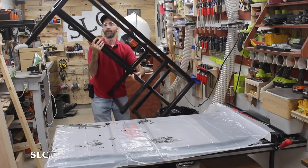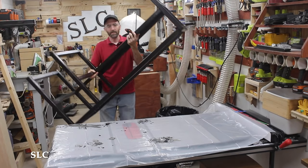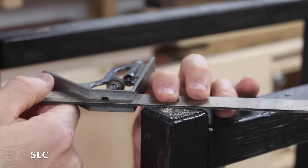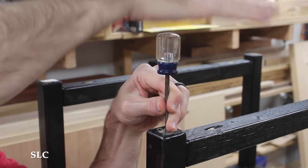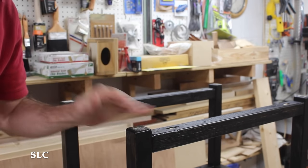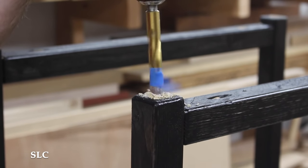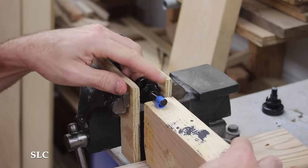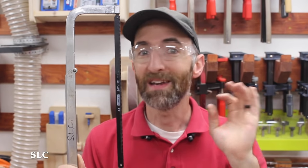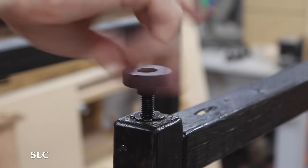After the polyurethane became dry to the touch, I flipped the frame over to install the levelers. This also gave me the chance to check the rigidity of the frame, which was very solid. To find the center of each leg, I used a square laying across each corner and made a mark with a pencil. An awl comes in handy to keep your bit from moving when drilling. Each leveler needed a half-inch hole, so I started with a smaller bit to guide the holes, then stepped up to a slightly larger bit, and finally the half-inch bit. To shorten the levelers, I clamped them in my vise with some wood to support the threads and used a hacksaw to cut off about a half inch. I then installed the provided T-nuts into the bottom of each leg, which provided the guide and support for the levelers, and flipped the frame back over.